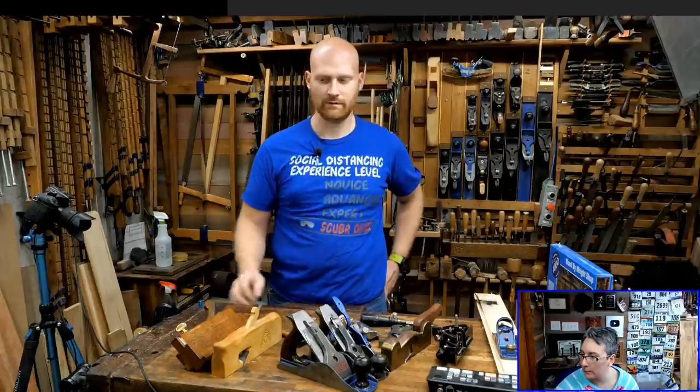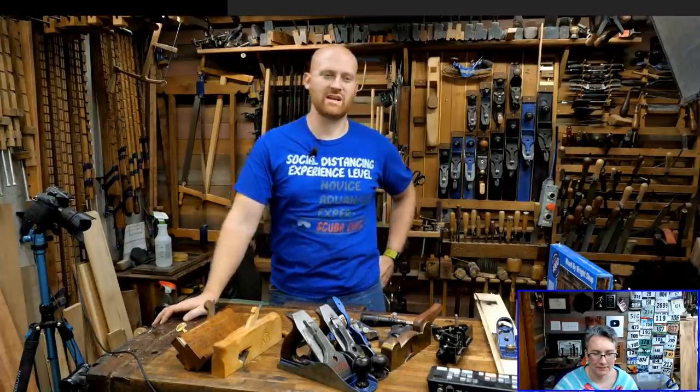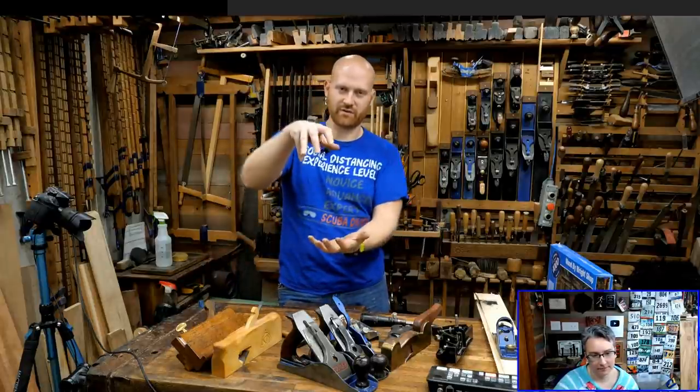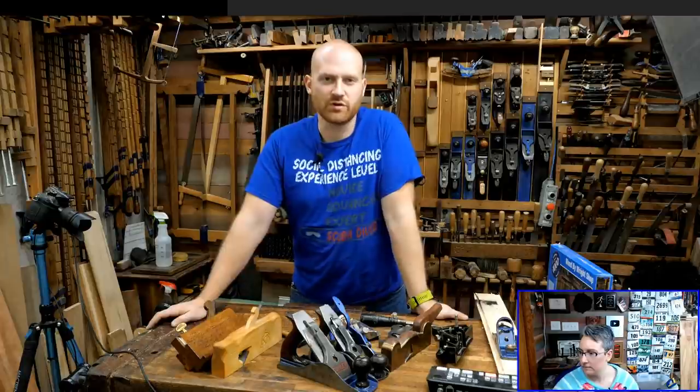Alan Smith asks: will James have another wood plane build project coming up? I don't have any on the list right now as my current build list is a bit long. But I would like to make another detailed smoother — ideally one with a Lignum vitae sole. If I can get my hands on a big enough piece of boxwood, I want to do a coffin smoother with a boxwood sole dovetailed into a white oak base, and actually make my own iron and wedge for it. I'll probably also do a couple more molding plane type builds and maybe another tongue and groove set down the road.